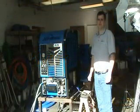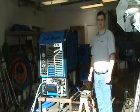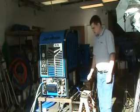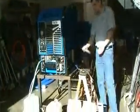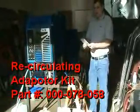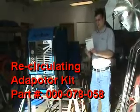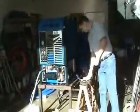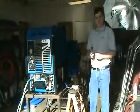In this segment, we'll show you how to freeze guard a Titan 575 to keep any damage from occurring during cold weather. The tools required to freeze guard are a recirculation adapter kit, part number 000078058, and the standard fresh water garden hose adapter that comes with your machine.